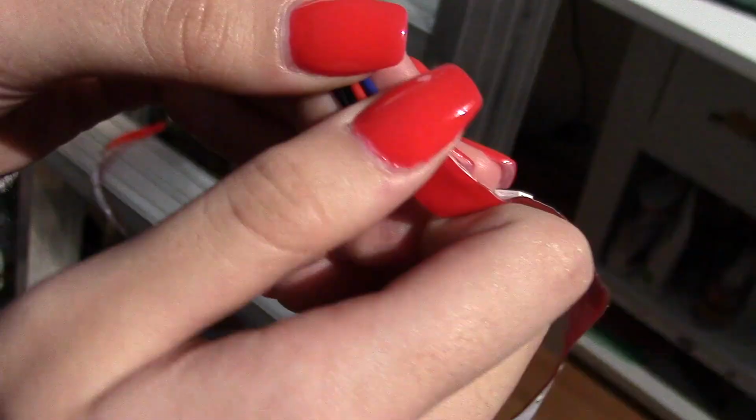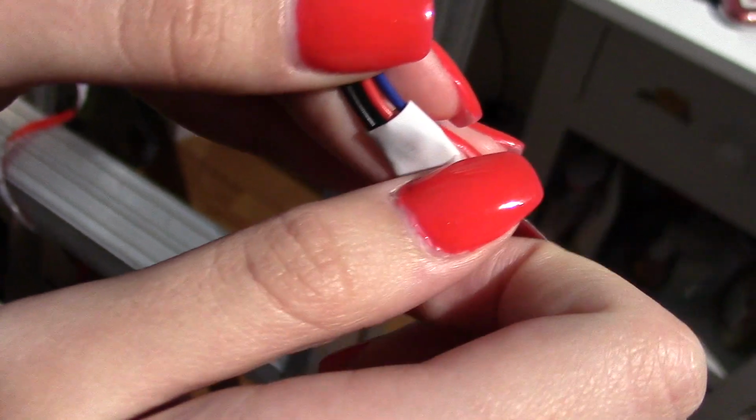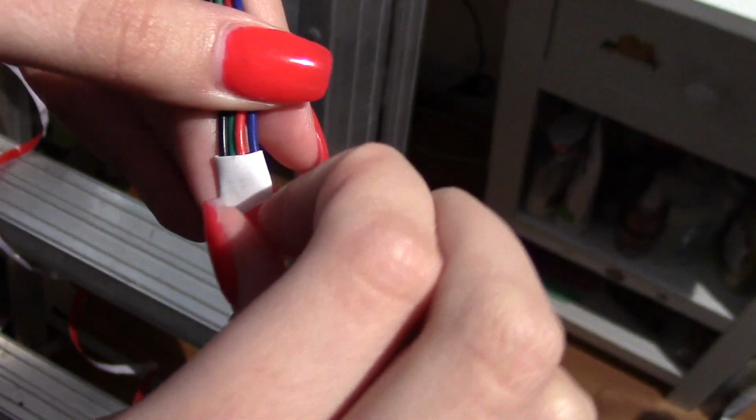All right. And so, we peel away the red adhesive protection about 2 feet at a time. And also, don't forget to wipe down the walls for any dirt and debris. This way, the LED strips will stick to the wall much better. Going to put it in here. We're going to start off from one corner and go up. And we'll tuck it behind the desk so we can hide our power cord and give it a cleaner look.